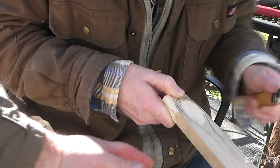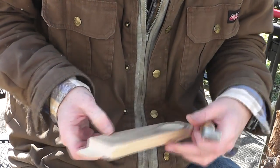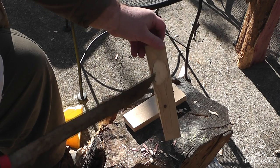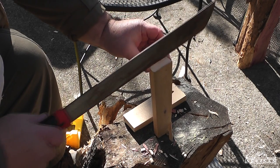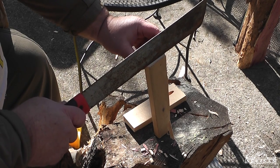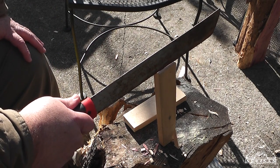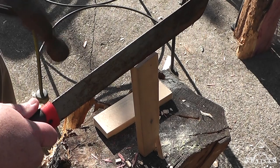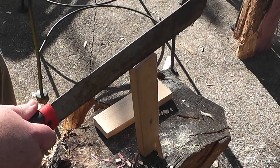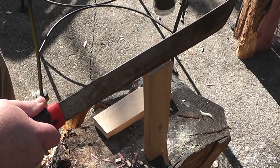The other thing you can do, Barrett, is we don't have to make the spoon that thick. On mine, I think I'm going to try to split it the other way. This is a little risky, but one way to make this quicker on a small spoon is just to not make it so thick. I'm going to try to pick a grain line — this will vary with the type of wood you're using. I'm just going to take off about 3/16ths. I've got this part of the blade lined up with the thickness I want.